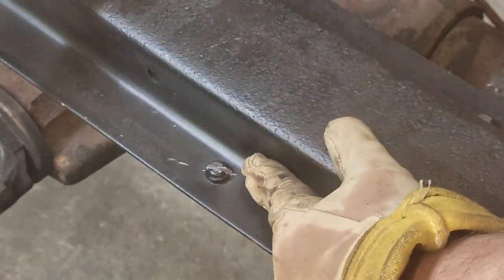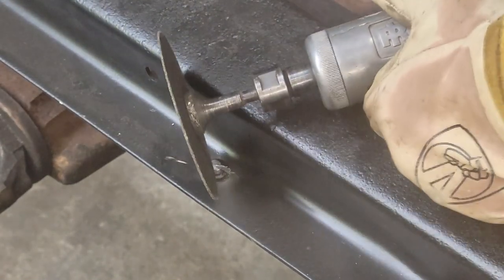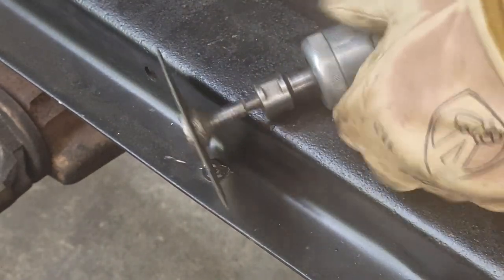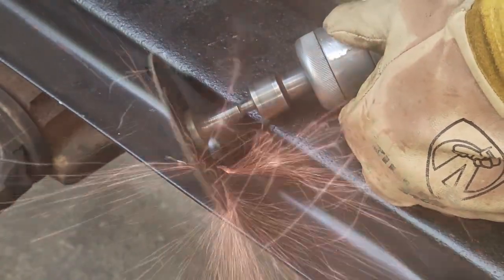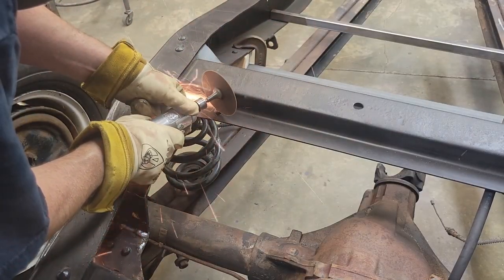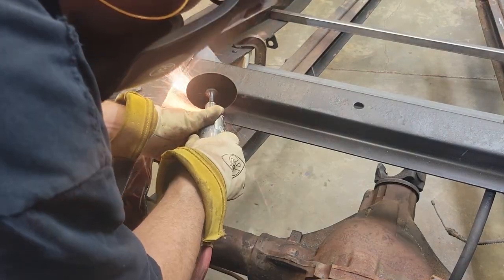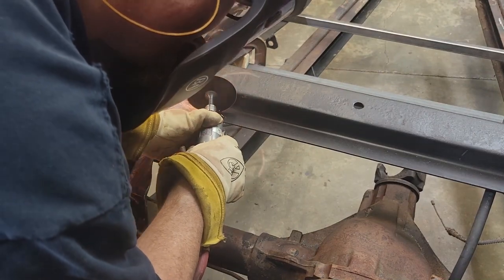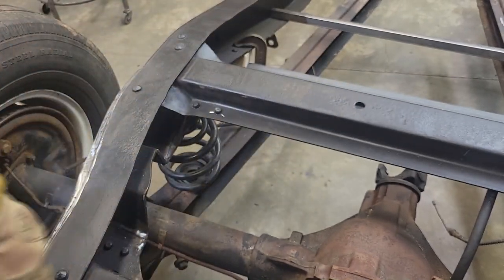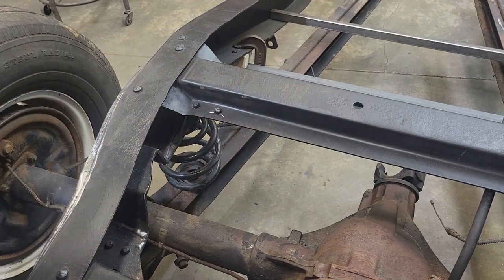What I do is stop when you start seeing it mark right at the bottom — just right there — then we'll cut the next direction to complete the X. Get all the angle you can and just watch what you're cutting. Once the X is cut, we're going to take our cold chisel — make sure you've sharpened it good, wear your PPE — and knock this off. Then we'll go over to the easy method.